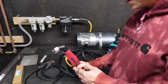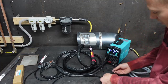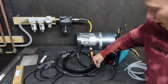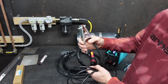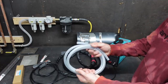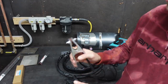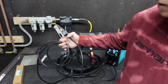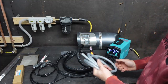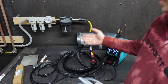Let's check out everything you get when you buy one of these. You get the torch, which plugs into the machine with three wires — your trigger switch, a second cable, and a third cable that feeds the air. You also get a grounding clamp — it feels extremely cheap but looks like it'll work, with copper contacts and a pretty strong spring. They also provide fittings and a flexible airline, though I'd recommend running your own airlines and fittings.